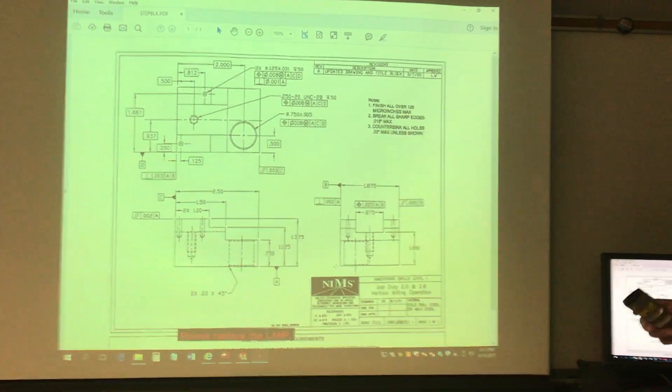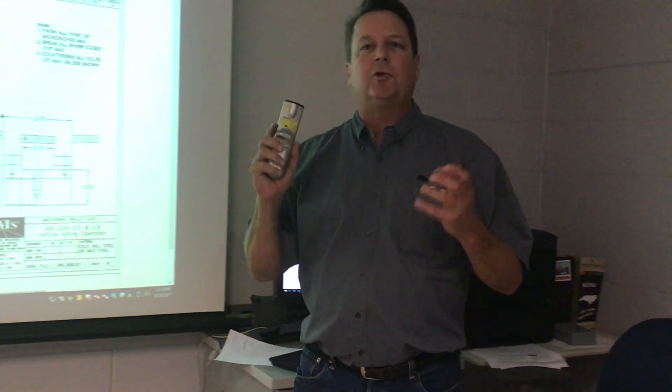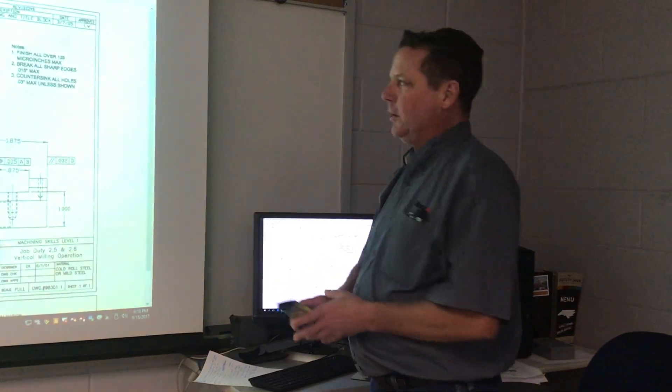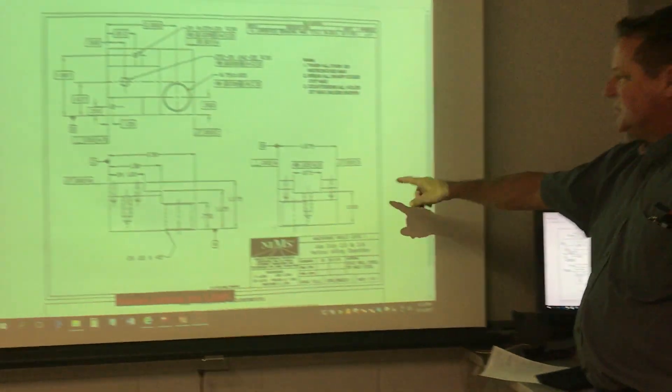The golden rule of most machining is to grab the part one time and machine all that you possibly can in that setup. The next part of the golden rule is to rough everything if possible and then finish everything — because if you have any problems in any one area you may still have stock enough left to save the part. So we're going to rough in all of these steps.